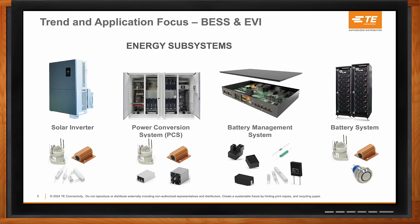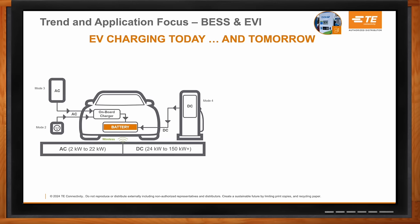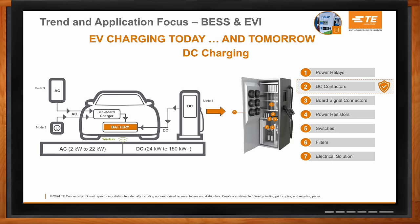These contactors are also a good fit for EV charging solutions. You'll see Level 3 EV charging stations in the U.S., typically ranging from 24 kilowatts to 150 kilowatts, with higher-power designs being done by engineers as well. That's where you'll typically see our ECK contactors — pictured here with the cabinet open, in conjunction with bus bars on the application.